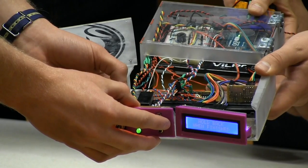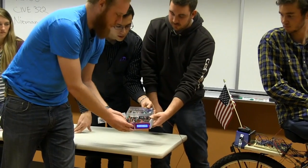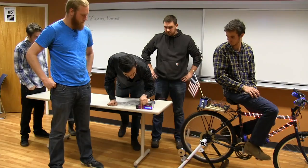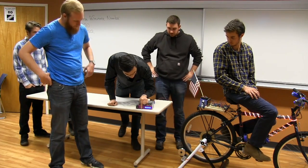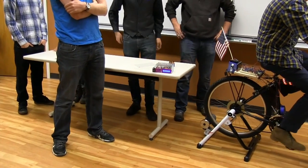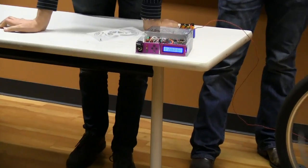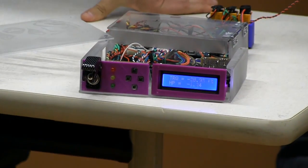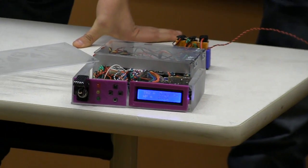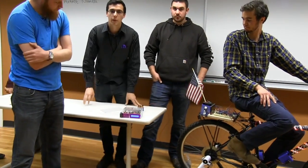All of this is controlled with our PIC-16F88 and our own H-bridge. We read position with the potentiometer through the PIC as an analog signal that gets converted to digital. It travels slower at the ends of the bounds when it reaches full tilt. The dynamometer calculates torque and horsepower as you're riding — it'll register a negative number when decelerating. When you hit back, it pops out and displays your maximum torque and horsepower recorded.